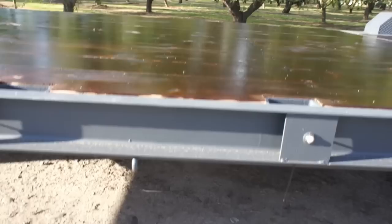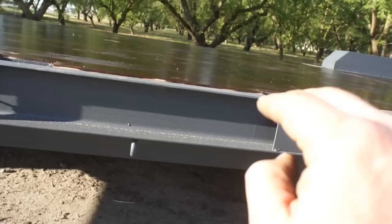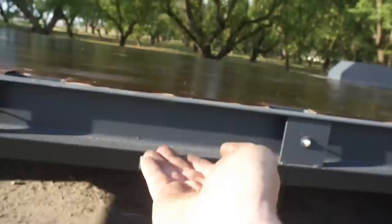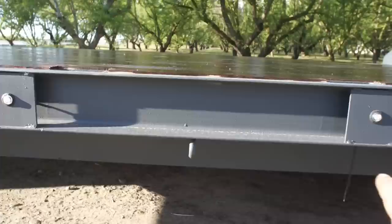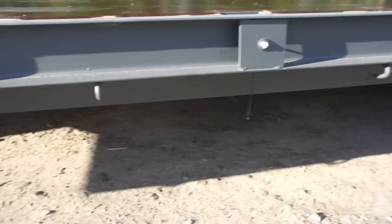There's a few things that I will be addressing down the road. One is, I think I'm going to put the spare tire underneath here. What I'm considering using is one of those strap winches right here, and then a pulley under the trailer that pulls the tire up. With all my measuring, it looks to me like the tire would not hang below that frame rail right there, and that'd be a perfect way to keep it up and underneath there, out of the sunlight and secure. And then you would basically just need a lug wrench to lower it down. That's kind of what I'm aiming for.